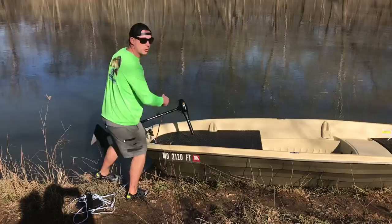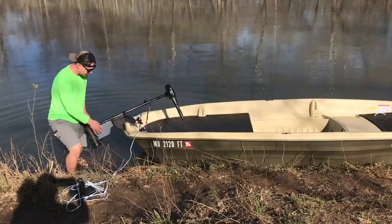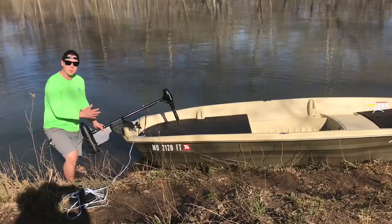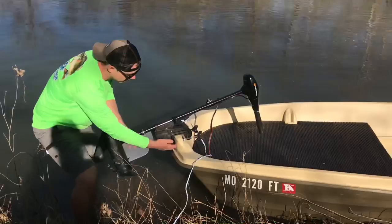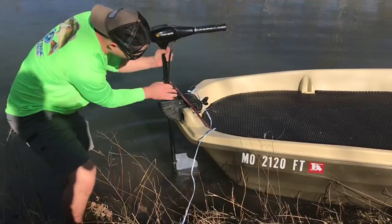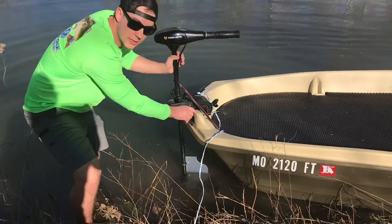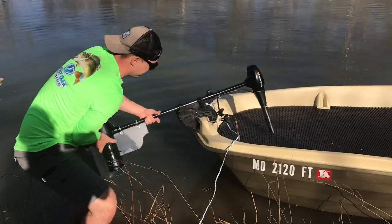Up here in the front, we'll start with the trolling motor setup. I have a Minn Kota Endura C2 55-pound thrust trolling motor. I also put a custom rudder that I made — I'm going to make a video on how to make this — which is going to help it steer a lot better since this is the only motor on this boat. I had to adjust the mount a little bit: with the trolling motor straight up and down, it was actually rubbing on the corner of the boat. So I put a little bushing in here, made out of a piece of plastic, to give it enough clearance to turn. Keep that in mind when you're buying one of these Minn Kota trolling motors.